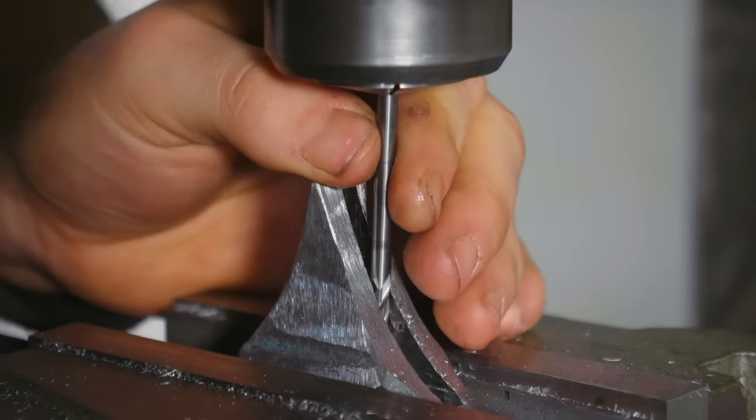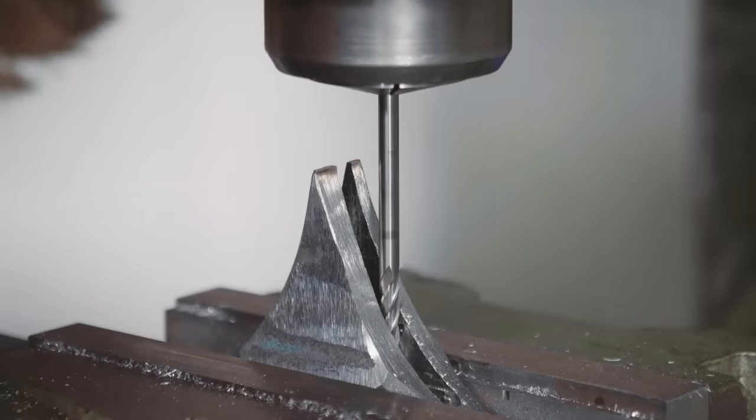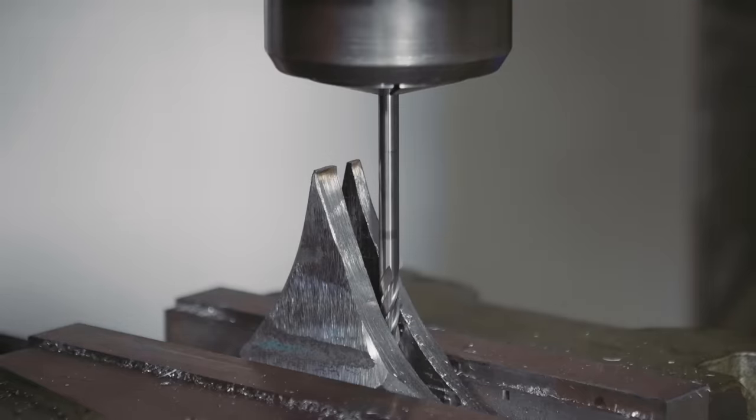Now the issue, however, is the tang hole. So not just the slot that accepts the sword itself, but the tang hole, the hole that allows the tang to go in and allows it to actually go up. That little hole right there, that's gonna be tricky to make because I'm about to be flat out of cutter, as you can see. And I need lots of that cutter to be able to get through the damn material.